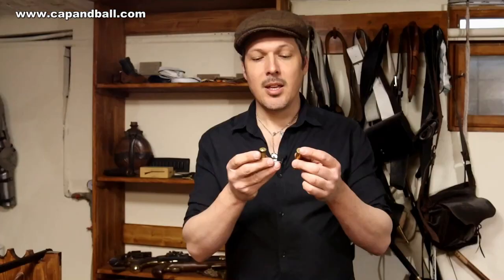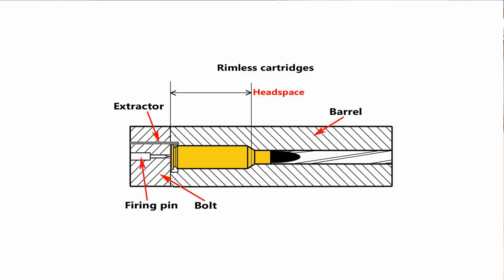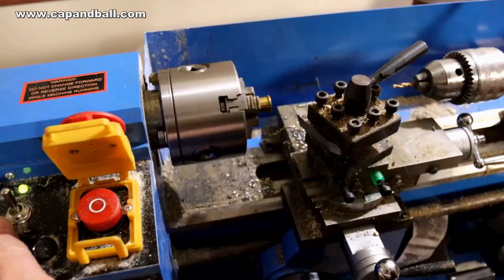To avoid damage, you must ensure the rifle closes properly on the cartridge. I will make the reformed 45-90 cartridge close on the shoulder and the bottom of the case — the same closing method used by all repeating firearms and rimless cartridges. This is why I will have to measure each and every step carefully while reforming this cartridge. Now let's start on the lathe.